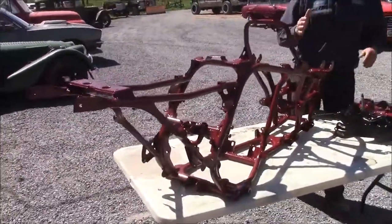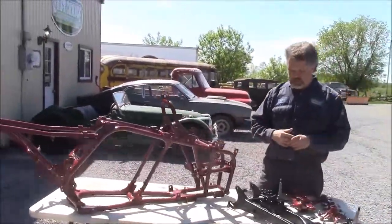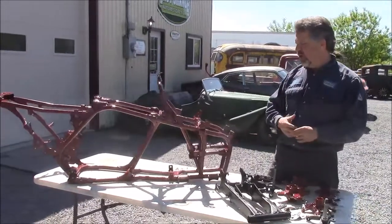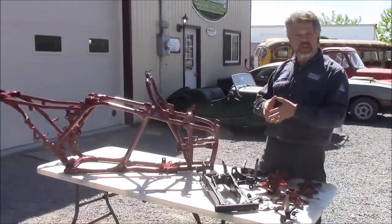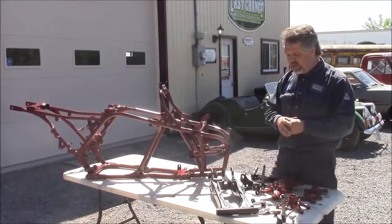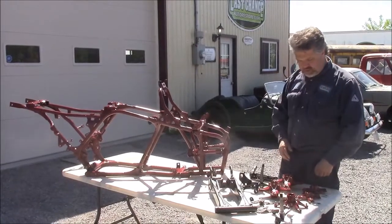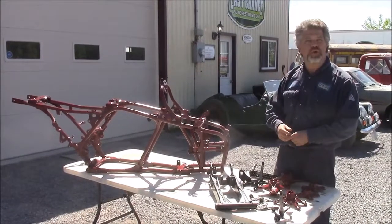Taking it from the very beginning where the client dropped it off, we degreased everything, made sure everything was cleaned properly. We prepped it all. We media blasted it through the Kingston sandblasting division that we have. And then once we prepped everything and gassed everything off, it went through our other division, kingstonpowdercoating.com.